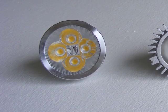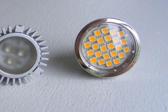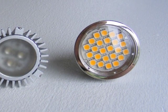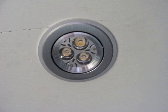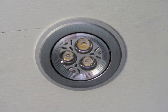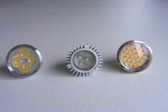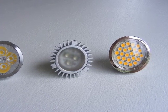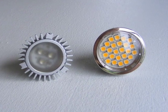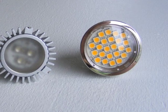If you sacrifice some lumens then you can go to a warm light, and if you sacrifice even more you can go to a very warm light which is more like candle. I ordered some warm down lights. These were brilliant but they don't actually give a very wide throw and it's a bit like sitting underneath a torch — the minute you move out of the beam there's no light available. I eventually found a very warm light that gives off a wide throw, and it's actually like sitting in a room with a lot of candles. You get a nice warm atmosphere and the whole room is filled rather than just a directional portion.